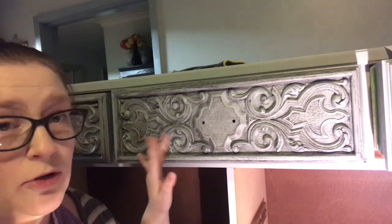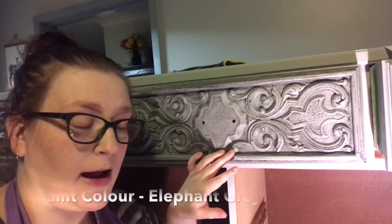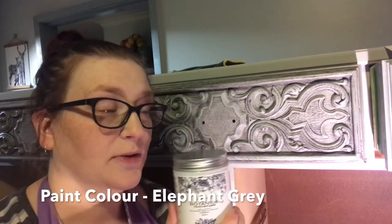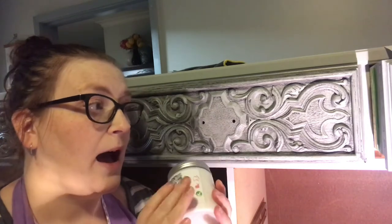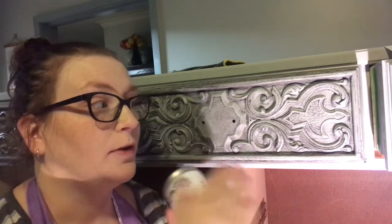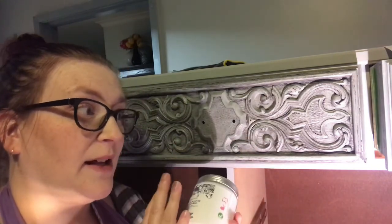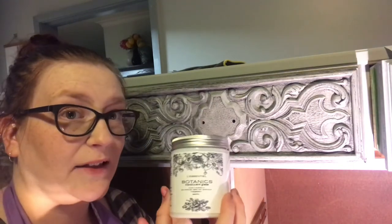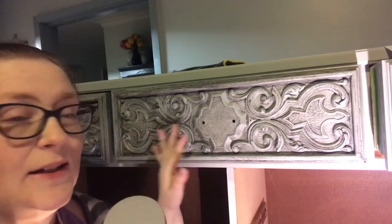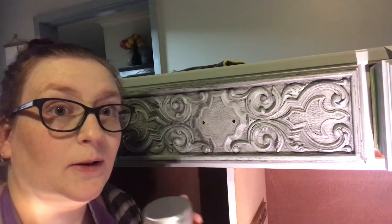With these drawers, I painted them with the charcoal grey and then sealed them with the clear glaze first — you'll see in a minute why I did that. You don't have to, but for the look I'm going for I found it much easier. The Essential Botanics paint is quite porous and will suck in this glaze like there's no tomorrow. By applying the clear glaze first, it makes it much easier to apply the charcoal and then get this really beautiful rub-back look.